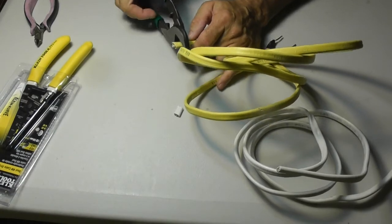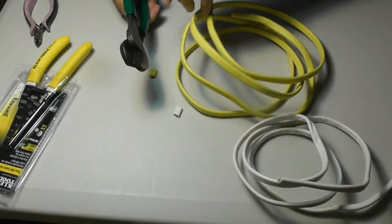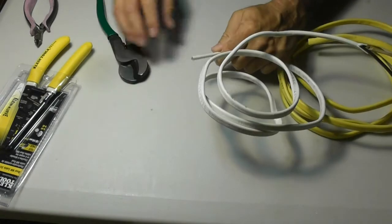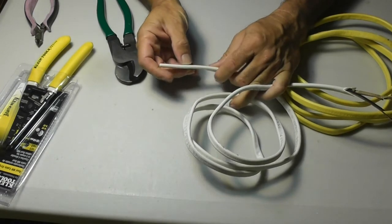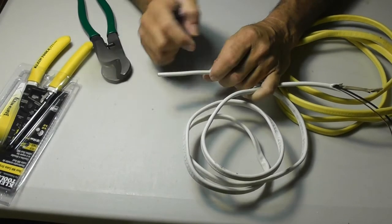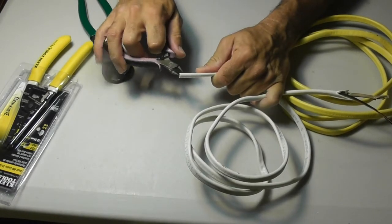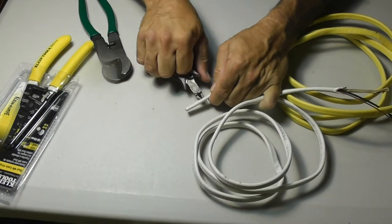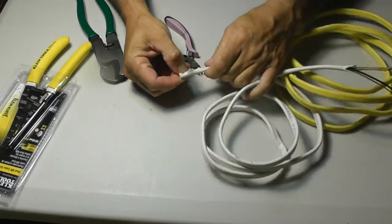So I'm going to cut the end of my wire. I'm using a lot of force — these are made to cut very heavy cable. After you get the end cut off, you'd have to strip back the wire at least six to eight inches. You could go to the store and buy a Romex stripper, or you go in with some cutters and start playing this ridiculous game of cutting the jacket. Maybe you're starting to see why getting the proper tool makes a lot of sense.